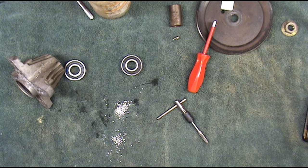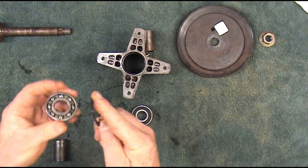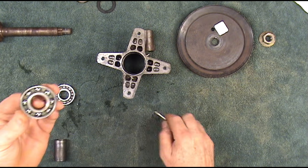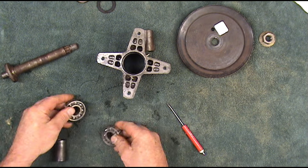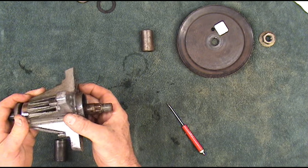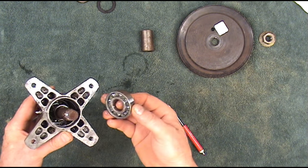I'm going to clean this up a little bit, and then we'll show you how to put it back together. Now remember, these old bearings didn't have any grease in them. So what we're going to do is actually remove one of the seals in each bearing — we're going to pop out the inside seal. These bearings just didn't use an abundance of grease, but we're going to put this together with the inside seal removed from the bearings so the grease will get to them. We got everything nice and clean and the inside seal is out. There's our spacer that keeps the bearings from getting crushed.